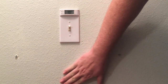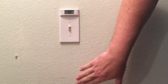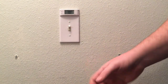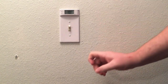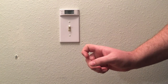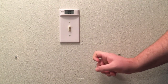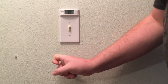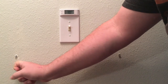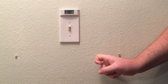Another thing you can do is use a magnet. What will happen is the magnet will find the screws or nails used to put the drywall on, and the magnet will stick — so you'll know there's a stud there because that's where the drywall screw is. Another thing that's a bit less reliable is you can knock on the drywall — you can typically hear the sound difference between the hollow space of the wall versus where it's right over top of the stud. Did you hear that? Hollow... not hollow... hollow again.